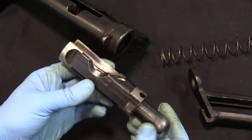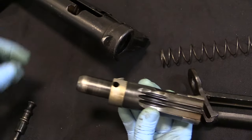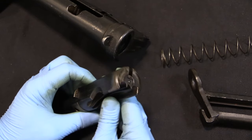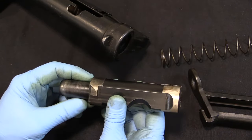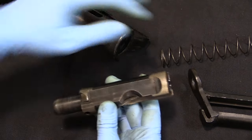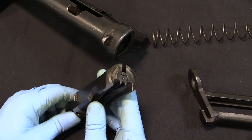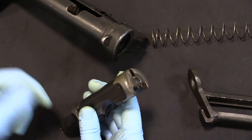There is nothing different or unusual about the bolt. The 7.62 Tokarev case head is basically identical to 9mm Parabellum — certainly close enough that the same bolt is interchangeable. The power of the two cartridges is also similar enough that you don't have to change the recoil spring or the bolt weight; these guns just work. As long as you give them the new chambering and a magazine that will feed reliably, that's all you have to do for this conversion.